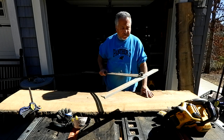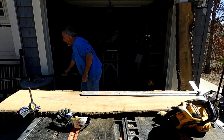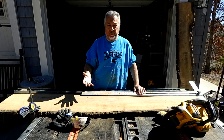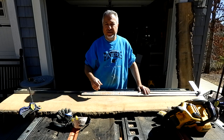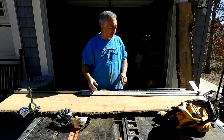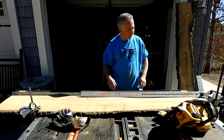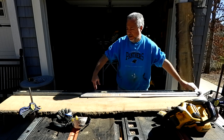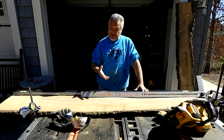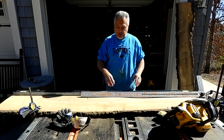I clamp it to the benches and take a T-square — I've already cut the ends with a circular saw. I do that before I let the wood dry so it doesn't bow and check, which means cracking. I paint the ends with a special compound that keeps that from happening; sometimes I put wax on there. So I take the T-square and this six-foot level, cut my pieces about six feet roughly, put the level on there, and draw a line straight across. For woodworkers out there: you can't just pop this on the table saw — it's dangerous, the wood is extremely heavy, and the bark just falls off. So you have to have a straight edge to start with. I cut one straight edge — I don't do both.